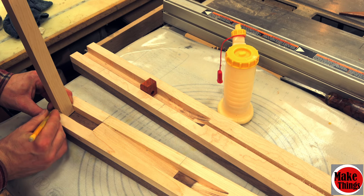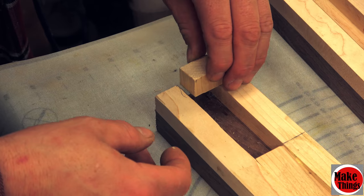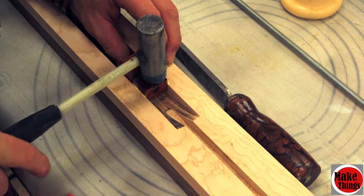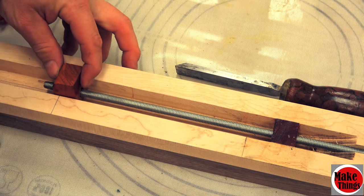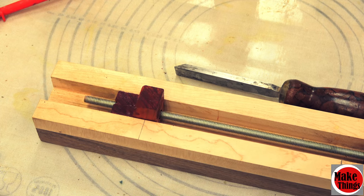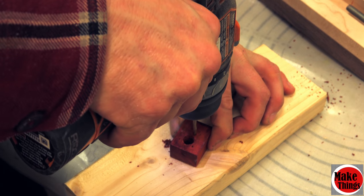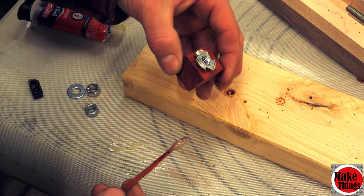We'll want to cut two additional blocks out for the ends of each half of the jig. With the half of the jig with the ramp on it, we'll go ahead and glue that on now. This half is now complete. Moving over to the other half of the jig, we'll add the guide block for the rod. The pin will sit right in the middle of the 11 inch mark, so we'll butt up the guide block to it. I threaded the rod in, moved the pin to the 4 inch mark, and put the end block in. Now we'll go ahead and add a t-nut to the pin by sliding in the barrel and giving it a couple of taps to get our marks before drilling out the holes for the teeth. Make sure you drill out the full width of the tooth to prevent breaking the pin. Afterwards I tapped it in halfway, added epoxy, before tapping it the rest of the way in.